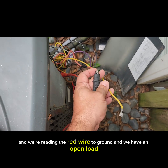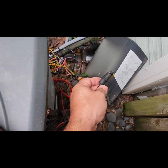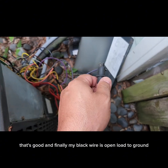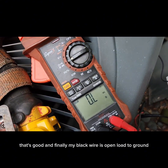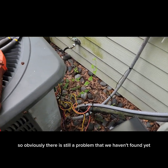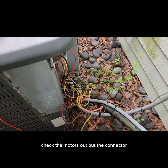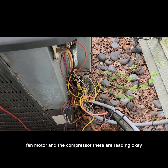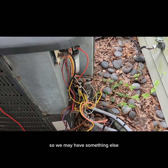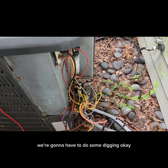Reading the red wire to ground — open load. Same with the black wire — open load to ground. That's good. And the final wire is also open load to ground. So obviously there is still a problem we haven't found yet, because we unwired everything, checked both the condenser fan motor and the compressor, and they're all reading okay. We may have something else — maybe a wire has rubbed out and shorted to ground. We're going to have to do some digging.